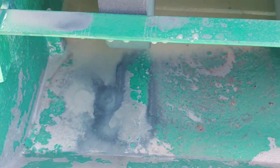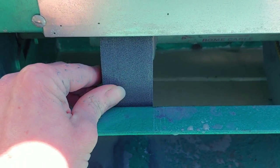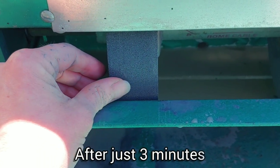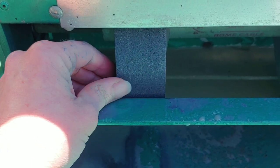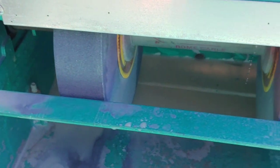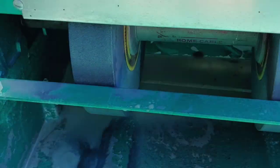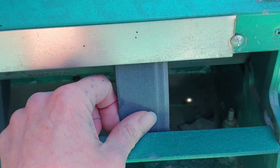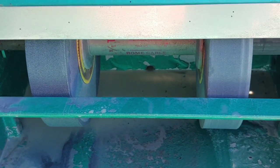Now it's gonna make a mess, but you should check it and feel it and see that it is perfectly smooth — and it sure is. You can even feel the difference in roughness. This one was pretty gunked up, filled with probably silicates from agate that I was working on. So next up we'll be doing the same thing to this one, just with the other grinding block that I have there, and these will be all trued and ready to go.